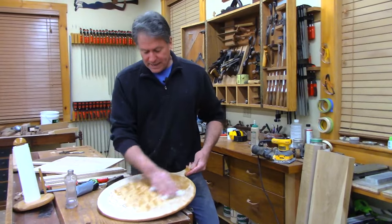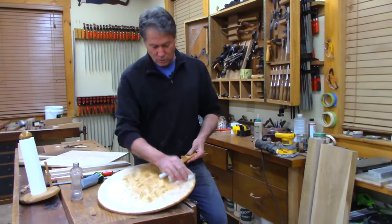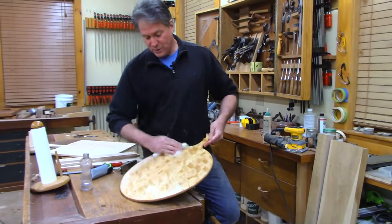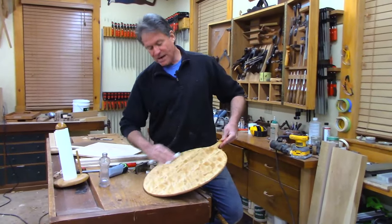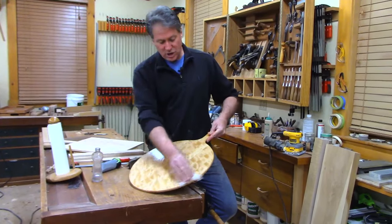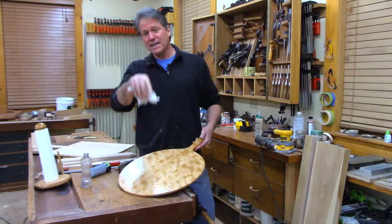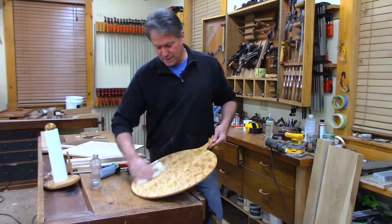I think you'll find the burn marks, usually it's some kind of pitch, or that one has a pressure-sensitive switch, so if you're trying to do too much, it's heat on the drum. When you're right flat on a drum like that, you do have heat problems, so you can't take too much off, and usually you're going to confront burn problems at the finer grits, but when you use an 80 grit like that, you're not taking too much of a cut, you're not going to experience any burning.